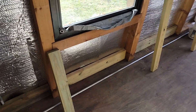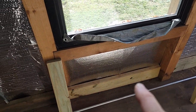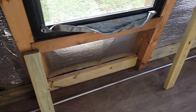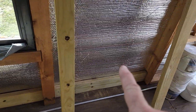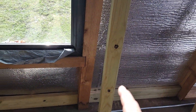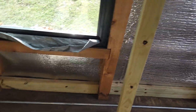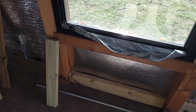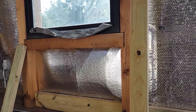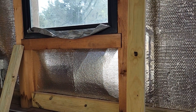Here's some low hanging fruit — all done but the finishing. Since we're using clichés, let me double up. I did the drywall down there in Tishomingo. Underneath these windows I use hardy plank. I need to put an outlet there, so I'm going to drill this out, put conduit through, and put a box right there. Then I'll feed it down through there. Let's do that thing.